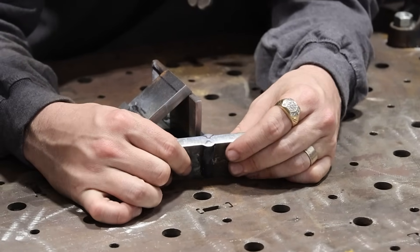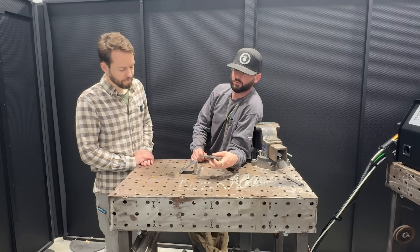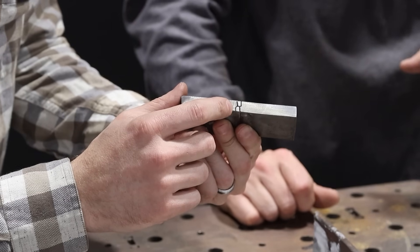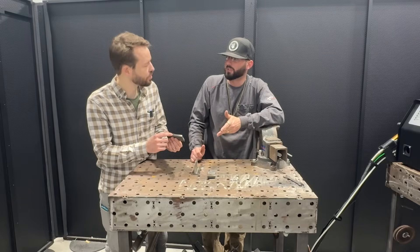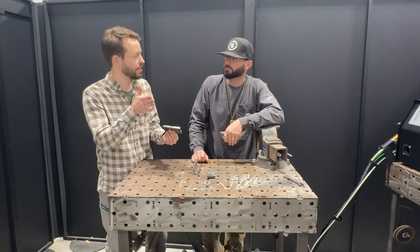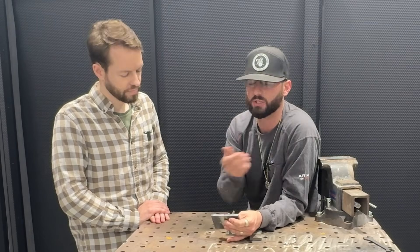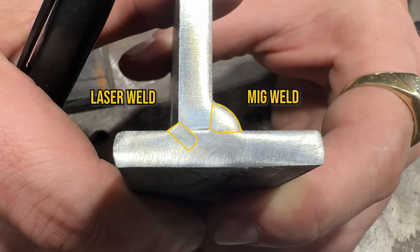We had to outline it in Sharpie a little bit — for better etching you'd really need nitric acid and a higher-grade polish. Compared to the laser weld, what are we seeing on that three-eighths plate? On the laser weld you can see we punched through from both sides and pretty much met right there in the middle, just as we expected. What surprises everyone is that the cross-section of your laser weld is actually square. The reason is because of the wobble that brings the beam left and right, and the beam is always penetrating the same depth — as it scans both sides that's what makes that square cross-section. We got full penetration. If you're wondering how much penetration lasers can have, obviously the XR with 1500 watts and a different focal point can get deeper penetrations, and if you go up to 2000 watts you can really handle some thicker metals — the depth of penetration is much greater than in the MIG weld, though apples to oranges.